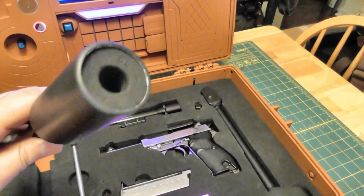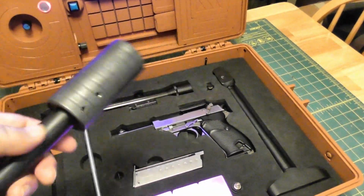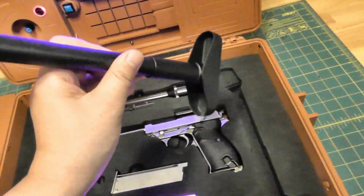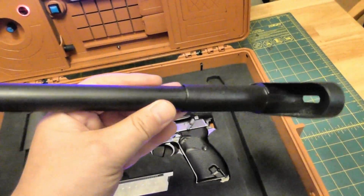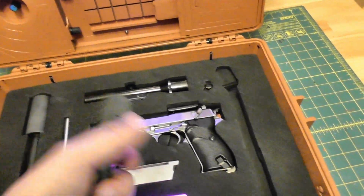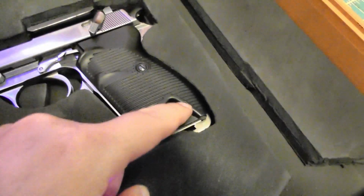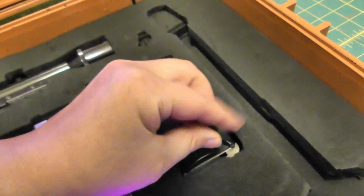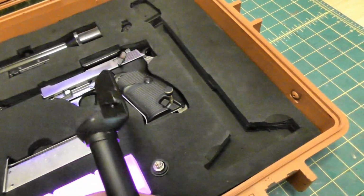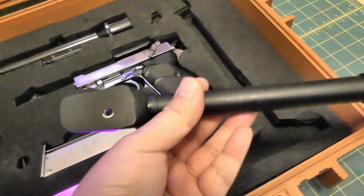This is just some scrap aluminum, put some foil tape down, and then heat shrunk around it, and that's all that is. So the stock, just some scrap. This is just a piece of plastic, some more polycarbonate tube, piece of aluminum angle that I put a little slot right there so that it fits into the spot where the lanyard ring used to be. I drilled it all the way through so that the 8-32 thumb screw can get socked in there. That little nubbin is there so that it doesn't rotate this way or that way, and surprisingly solid.